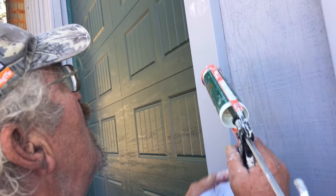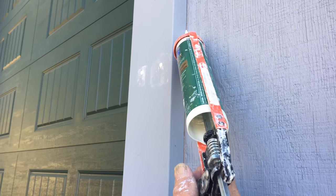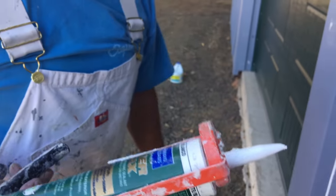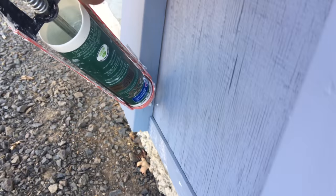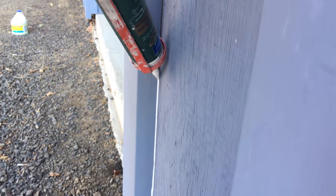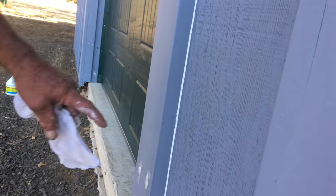See, now you have pressure because you have pressure on the trigger. So you just release — no caulking comes out, see, nothing coming out the end. Then you just keep your tip clean. Make sure this is seated when you have pressure on the gun, release, and look at that. Look how clean that is.